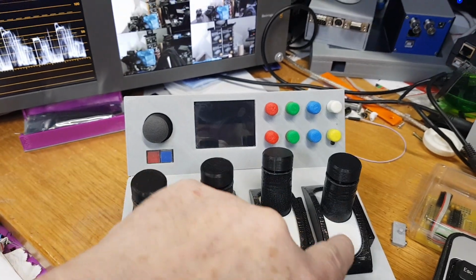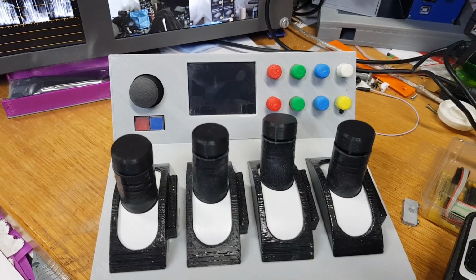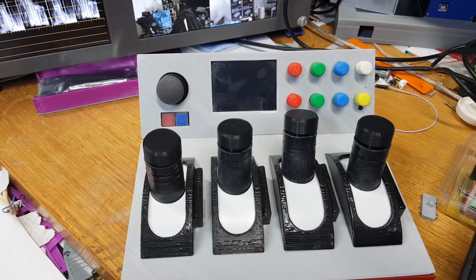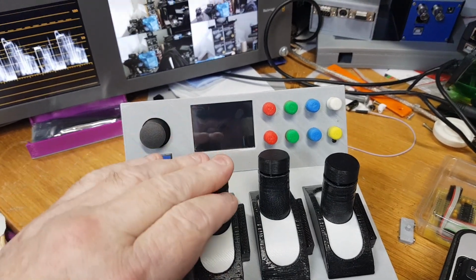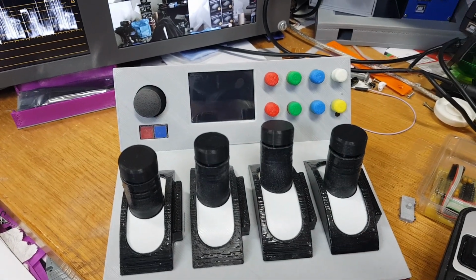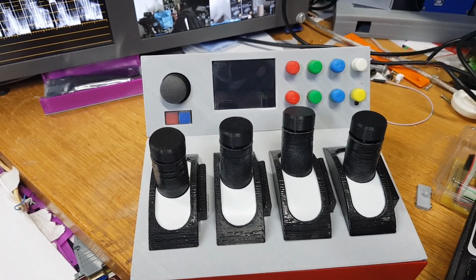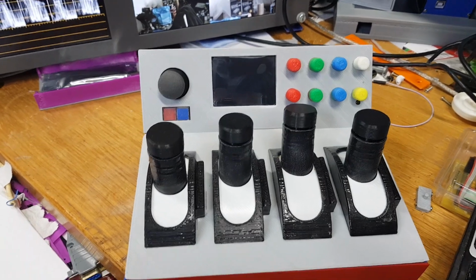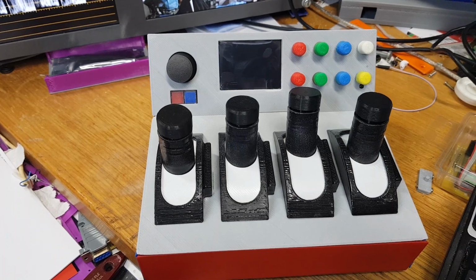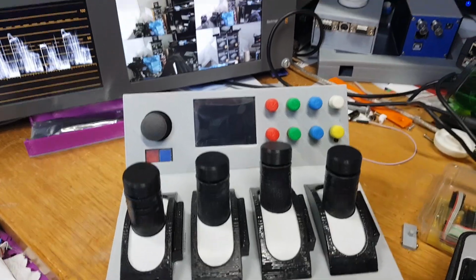The white areas here you'll see in a moment will actually display tally lights, red for on air, green for on preview, and blue for when it's selected on a selected aux bus, because these push buttons on the Iris controls can also give the ability to switch a router, be it either an ATEM aux bus or a video hub, or it can even switch a multi-view 4, which I've used in previous CCU controls.